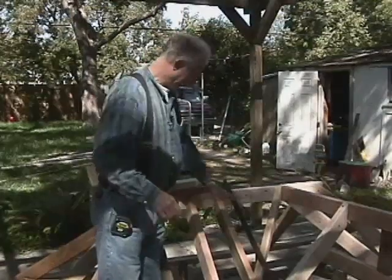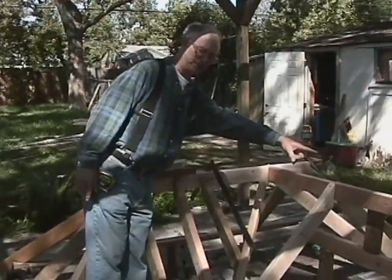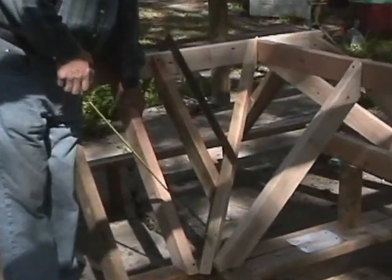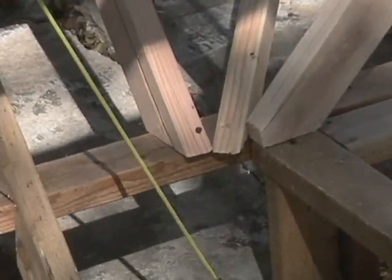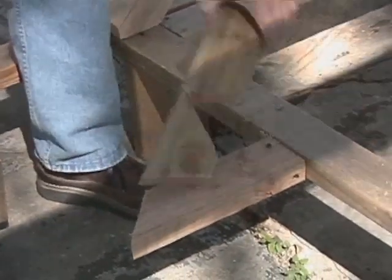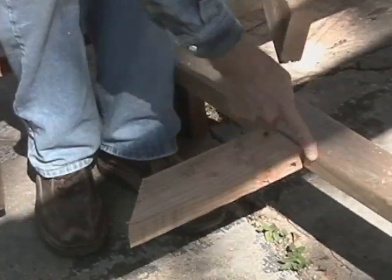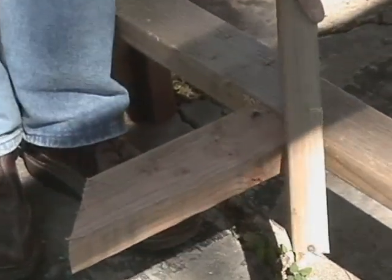Before we get into where our 12-pitch roof intersects with our other 12-pitch roof going at right angles — as you can see in this corner down here, this valley rafter should have continued on down, but we left it like this because I want to show you in a little more detail. When you try to put a board into the corner coming at a 45-degree angle, you've got about a 1-inch space that fits in there.